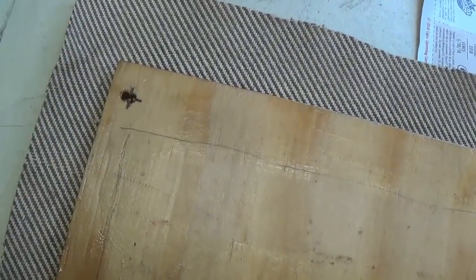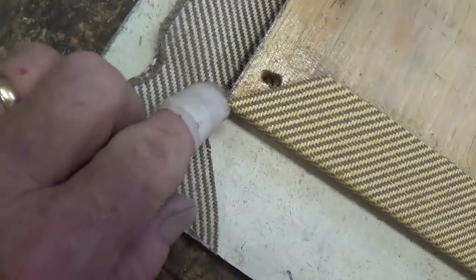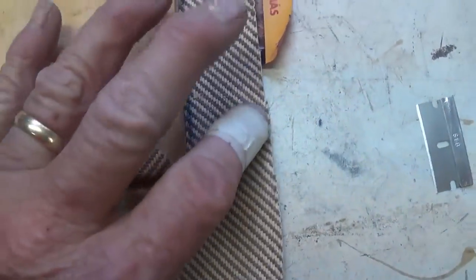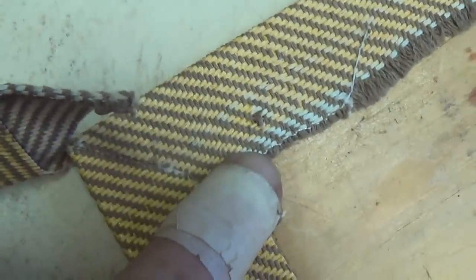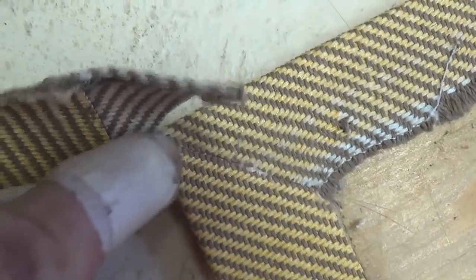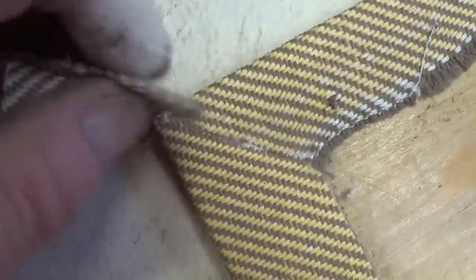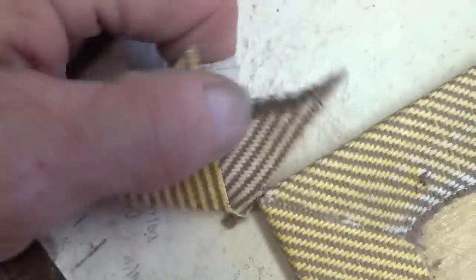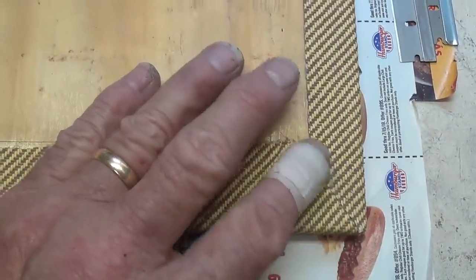I'll show you how it ends up. Now after you've rolled it down really hard, then cut a 45 degree angle and continue that cut all the way down to the bottom of the wood so that this side just lays flat. Next we're going to fold over the sides. Then after you folded this side over, cut a line exactly matching the 45 from below. Take away the extra, press it, and you'll have an invisible seam, and then use scissors to cut this corner. Now the back of the panel should look like this, held down really tight with nice clean mitered corners,